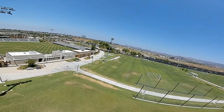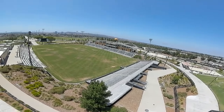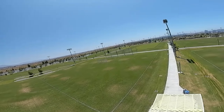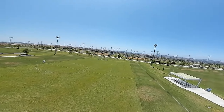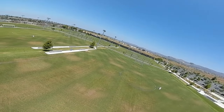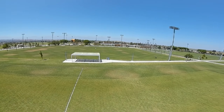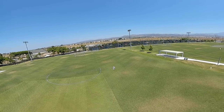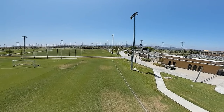Voltage is stable at 14.7 volts. If you're willing to put a bigger 1000 milliamp hour battery on, you'd get significantly more flight time. It's really windy — this thing must be fighting a ton of wind, which explains why battery voltage is lower than expected. But it's flying remarkably smooth given these conditions. The OSD glitching seemed to only happen when I got closer to the home point.